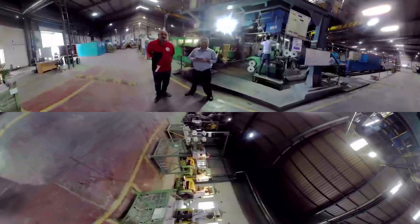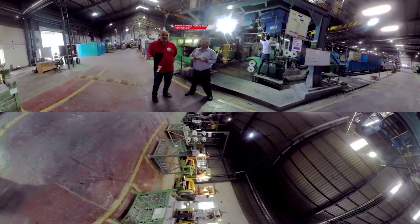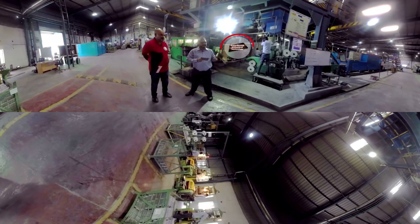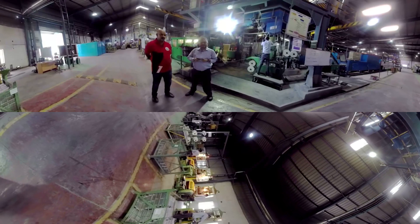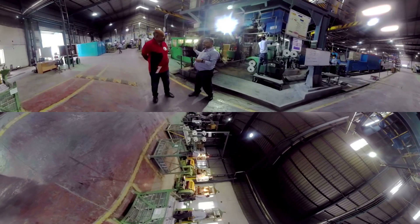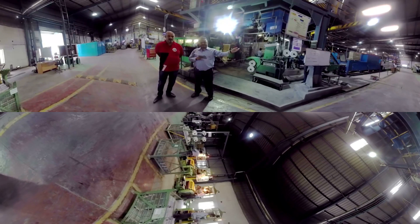Now we are in the second process of plate manufacturing. This is called the expander machine. The grid of Livgard Batteries is made with advanced and latest technology which we call super-strong active grid technology. We get consistent thickness of plates by using this technology. This machine is automated with advanced robotics. At the input we load the foil released from the strip caster and at the output we get the finished ready-to-cure plate.